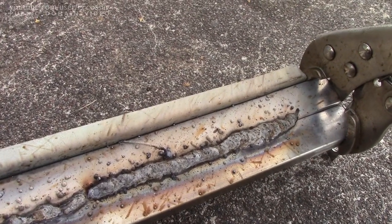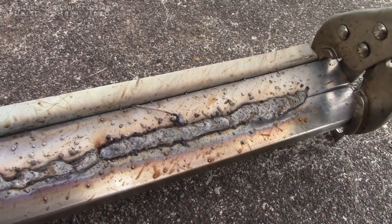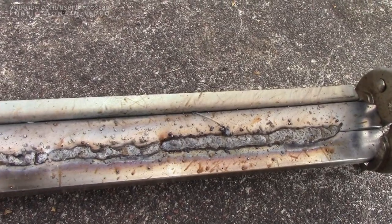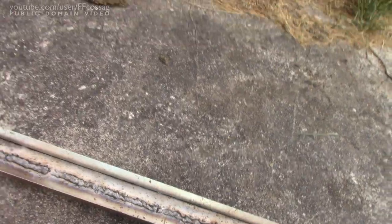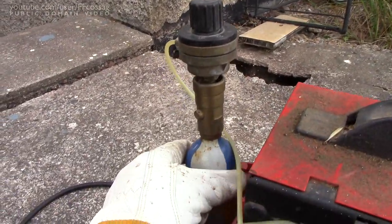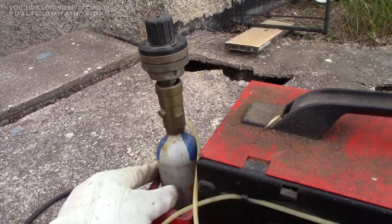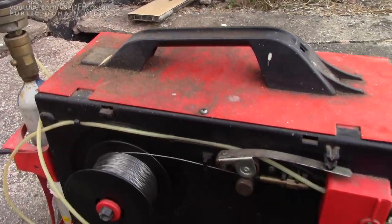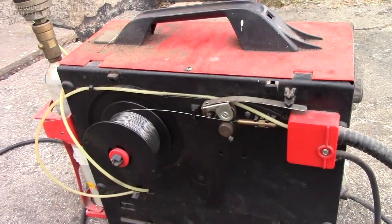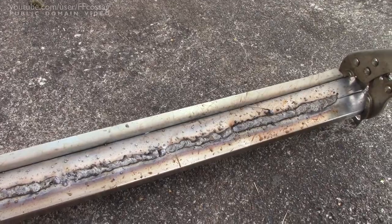Previously it would just kind of stop all of a sudden — no matter what you did it would never ever work this smoothly, unless you were using gas. But I don't have any gas. That probably just gave me enough hysteresis to actually allow the wire to stop feeding. Sadly though, this welder has a very odd gas bottle on it which you cannot get refilled and cannot get replaced anymore without spending stupid amounts of money. So flux core wire it is. I have no idea where the side cover of this thing is — I've never seen it. But I think this is going to do for my project. So thank you for watching. Cheerio.